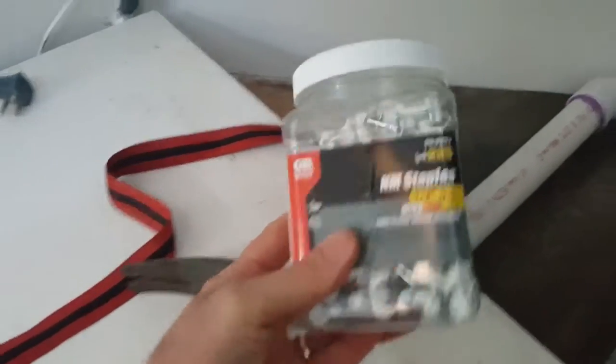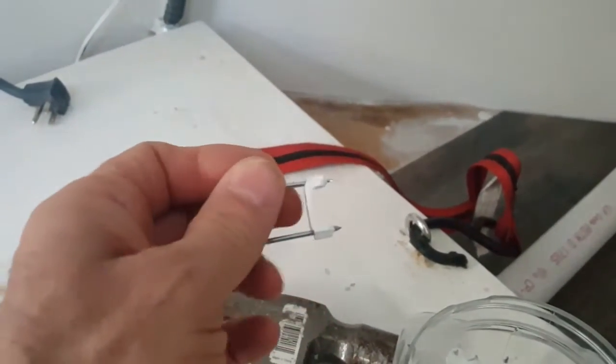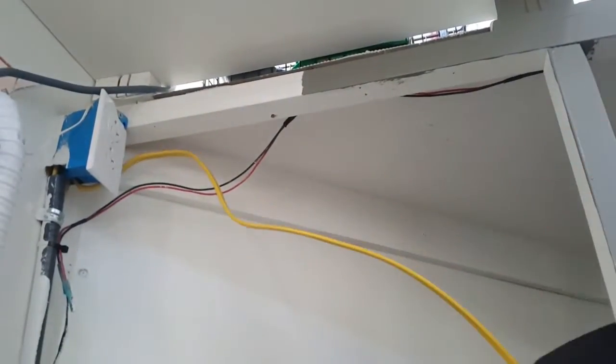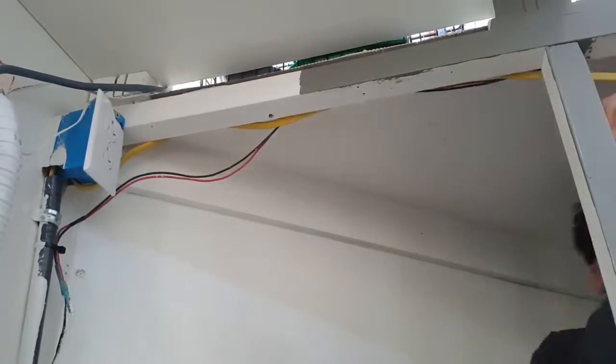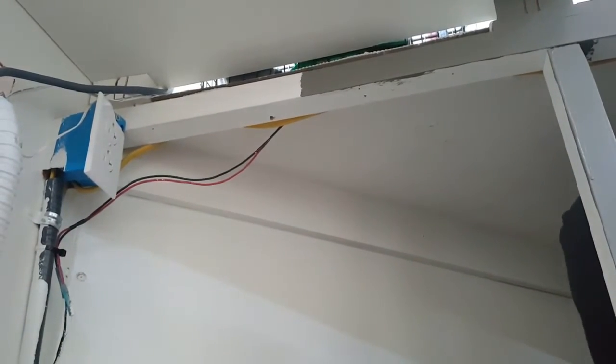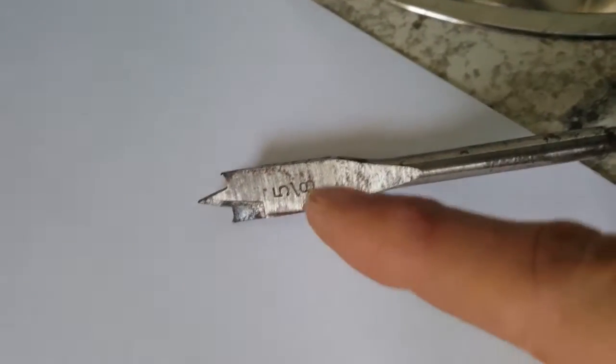Now I'm going to use a hammer and some mini staples — what this does is allows you to hammer these nails in and the plastic holds the wire in place. I've got 12-volt wires for the water pump and I've got the 110 wires. The 110 wires are anchored there, the 12-volt wires are anchored here, and they go all the way across underneath this lip which will protect them from getting damaged. So I'm going to use a 5/8 wood drill bit.